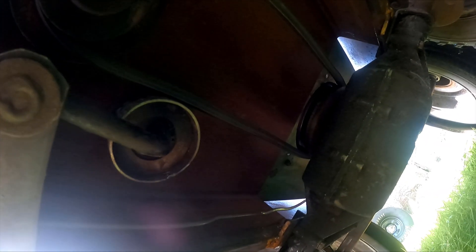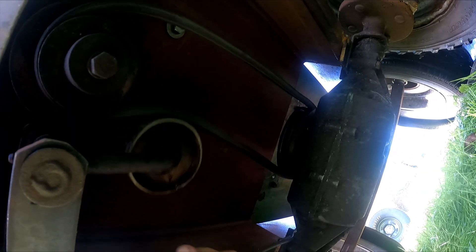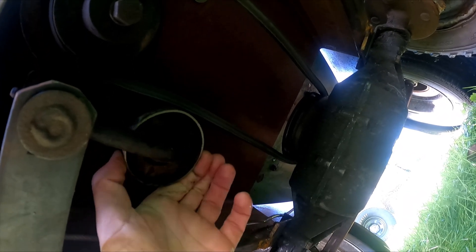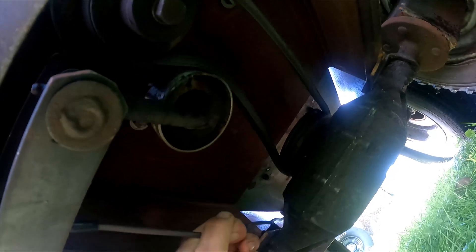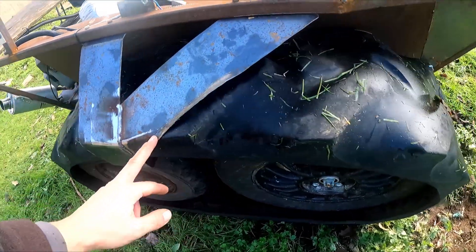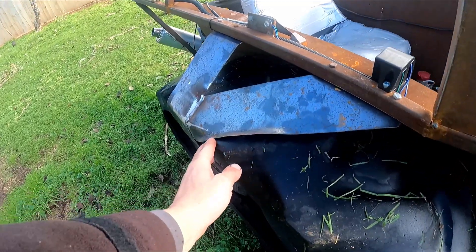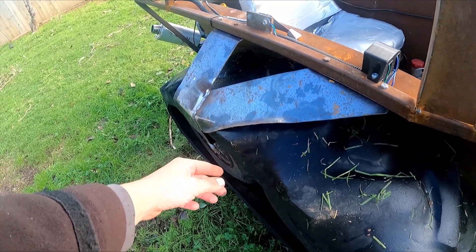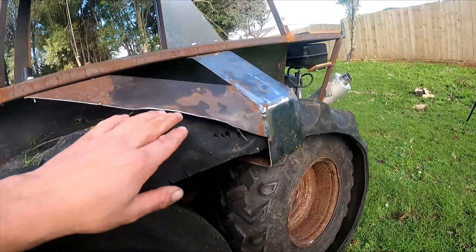I changed the belt setup to a push system - when you push the pedal it tightens the belt. I've welded a pipe around the outside of that pulley and put it on the other side, which works way better. It's a little bit grabby but the tracks were walking off in reverse, so I made these little sweet jet fighter wings here that actually hold the track on when you're going backwards. I think the tread on the tyres was trying to peel the track off the side but now it can't.